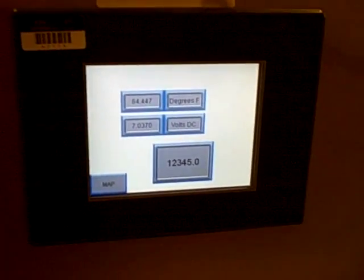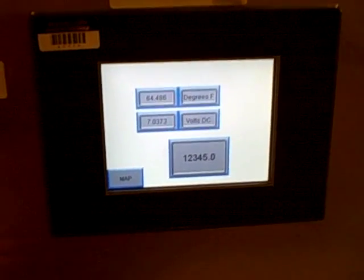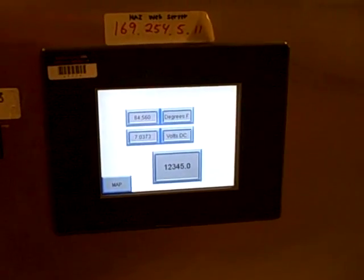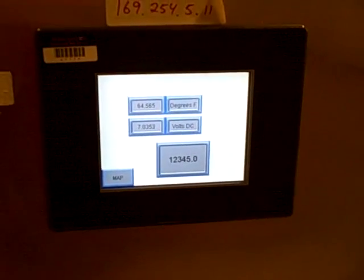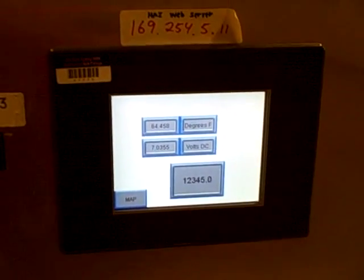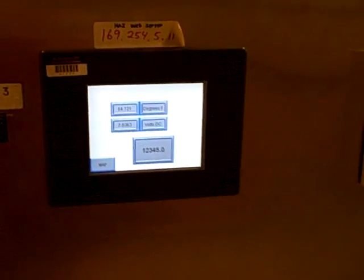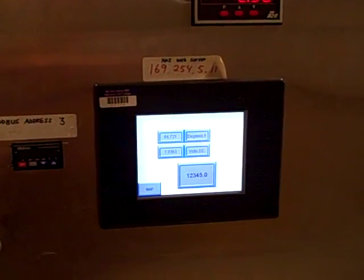Modbus, as archaic a standard as it may be, is pretty much ubiquitous among industrial control devices. If you have connectivity between devices, it's common that we'll talk Modbus, which gives us a way to get data in and out of devices made by different manufacturers. This whole setup took just a few hours, including commissioning the WirelessHART devices, Ethernet network configuration, and Modbus mapping — it would have gone faster had I been more familiar with the procedure. It's all set up now and working, a smooth illustration of what you can do with WirelessHART, especially with the new one-second update rates.